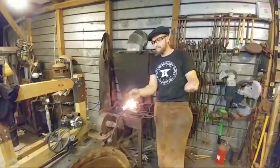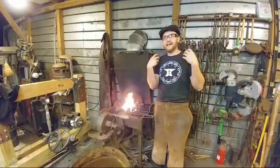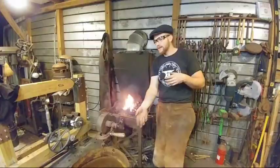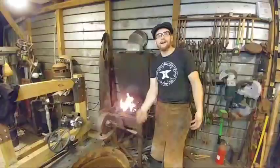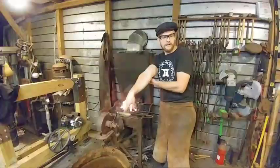Well, you can do that with hot steel still. It takes longer with hot steel, but eventually it will fail on you. And so if you've got an hour or so into tongs, it's just better to go ahead and make a new set of tongs for each size versus constantly changing between them. As far as a failure point, I'll put a number on it, maybe 50 times. I don't know, it's probably sooner than that before they would fail. Not advisable, especially if you spend a lot of time on them.